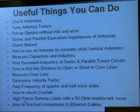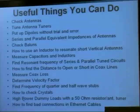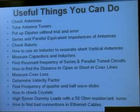Sometimes you need a dummy load and it's not 50 ohms — you need some weird value. Instead of buying a bunch of dummy loads and putting them all in series and parallel, I'm going to tell you how to use an antenna tuner: put a 50-ohm dummy load on the output, then take a small resistor — whatever value you want, 300 ohms, 59 ohms — put it on the input of the antenna tuner, tune it up, and you can make yourself a dummy load equal to that value of resistor to handle that amount of power.